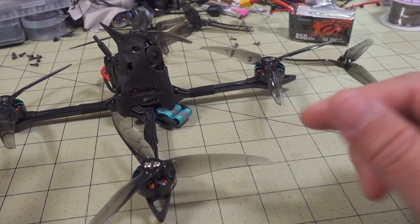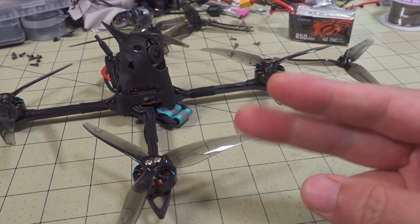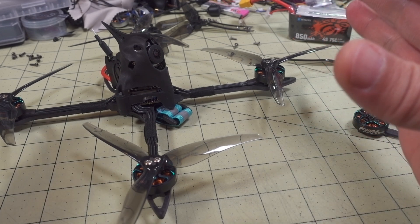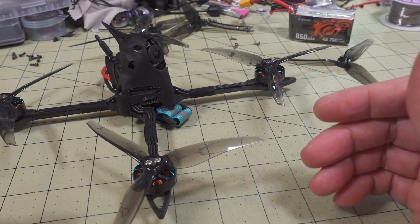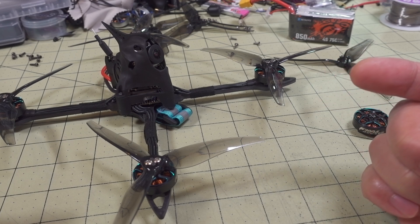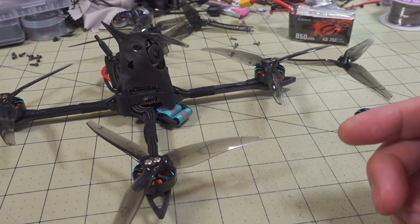You can look at the previous videos with the Beta FPV motors and the lighter analog setup to see how that flew — I'll link those in the description. So basically, if you get the stock X-Night 5 analog and do the digital conversion, with the weight going up about 20 grams, I would recommend increasing your P gain roughly 10 to 15 in number on both pitch and roll, and then maybe 10 to 15 on D gain as well — maybe a little bit less, like 5 to 10 on D gain. Start with that, see how it feels, then move up.